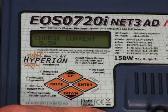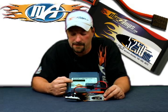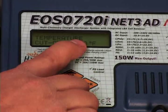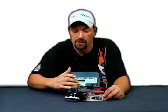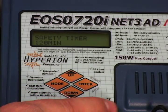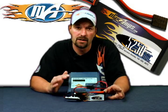Once that's done, go to your charge rate. Once you set the pack capacity, the charger automatically sets to a 1C charge rate, so we're already seeing 5.3 amps on the screen. Hit the enter button and then down again. You're going to see your temperature cutoff. If you're using the external add-on temp sensor, set your temp cutoff to 120 degrees. Press down and move to your safety timer. Safety timer set for 120 minutes. Standard charge time on an empty pack at a 1C charge rate is usually about 80 to 90 minutes, fully balanced charge, so 120 is a good safety point.